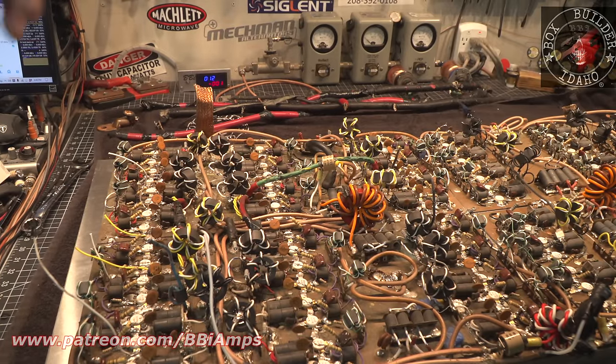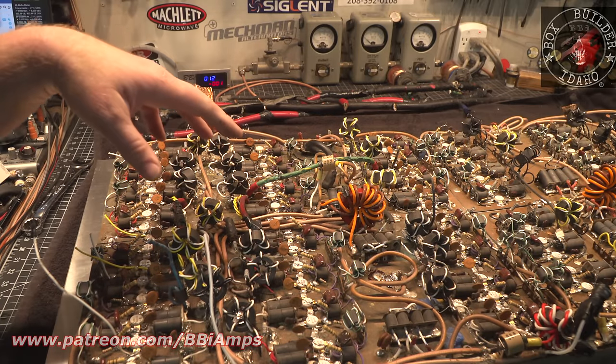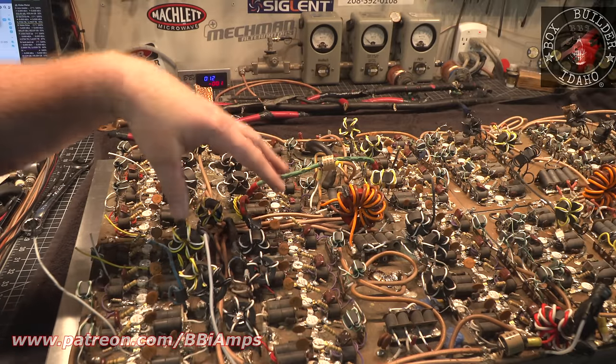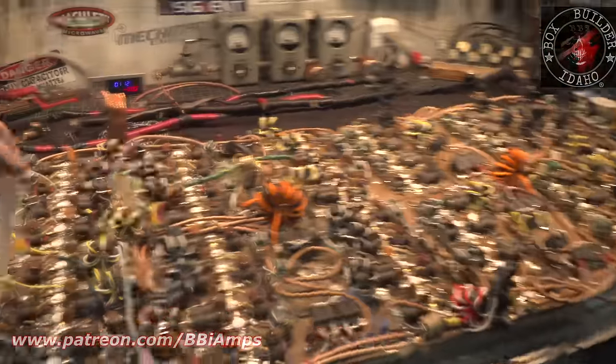In this particular situation, the previous builders offset that by putting the blower right here. Now, in the south and in the east, where there's this thing called humidity, right? That means a lot of moist air has been pressed down on the board and has sat here. That's the reason that the board is discolored and heavily corroded right through this area. But when we get up to the front, it's relatively clean. Got it?